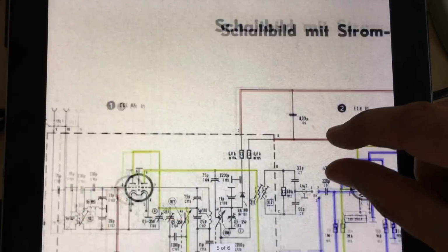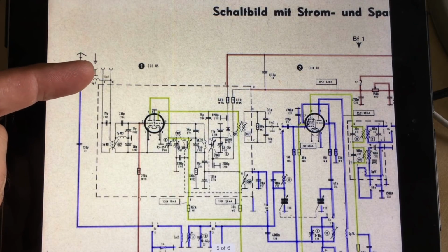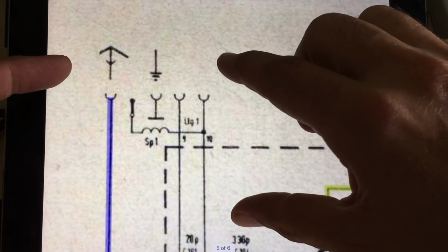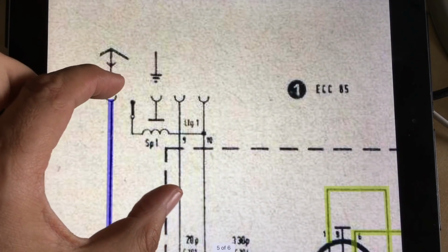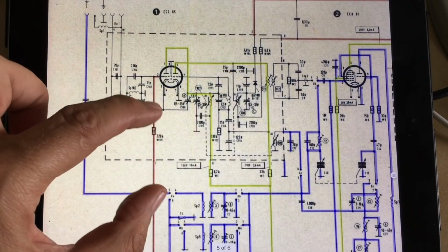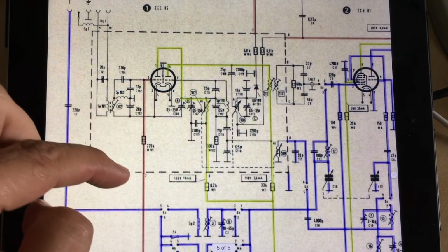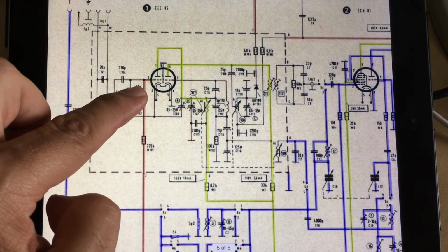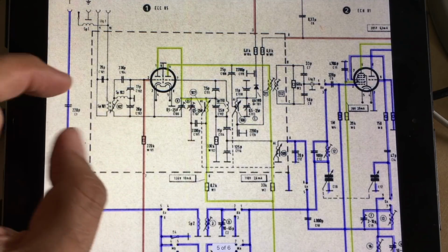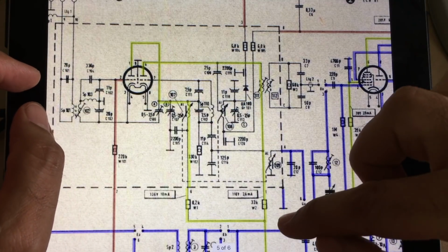But I have not looked inside this thing. I've simply checked the connections coming in. And the connections coming in are, it's actually quite difficult to see the numbers of the pins here, but this is 9 and 10, that's the FM antenna. Then we have this pin 2, or connector 2, is that connector that comes from the automatic gain control capacitor to the grid of the ECC85. The other connectors are 1 and 6, which is the B+.